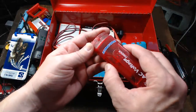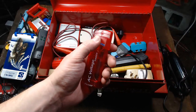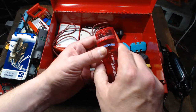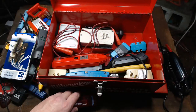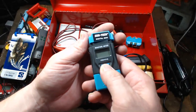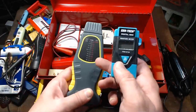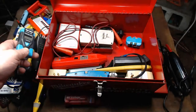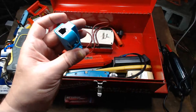Another inductive voltage tester, but this is a Zircon — more designed for in-wall use. Any modern stud detector will have a built-in live wire detector, but this is a dedicated unit. You drag it across the wall to identify live wires so if you're drilling a hole you don't shock yourself. I also have a Harbor Freight moisture meter — it does not work as well as the US General one, which seems to be a lot more sensitive. I may make a video comparing both.